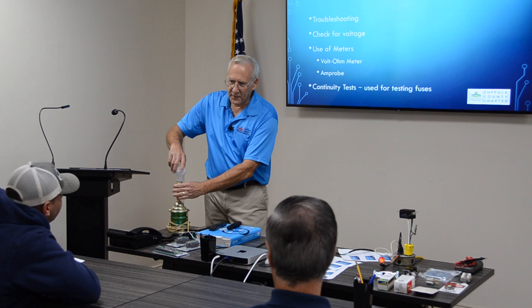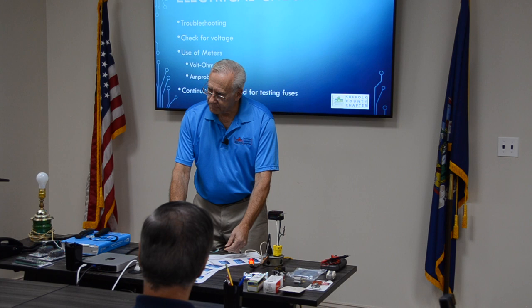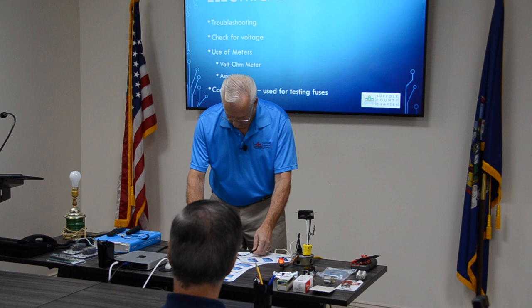All right. Okay, let's start over again. I want you to get this concept because this is why you're here. I plugged in the light, and all I did was open up the neutral here. That's all I did, I just separated the neutral. Normally when they're connected, the neutral's connected, everything's fine. The light works. Okay?